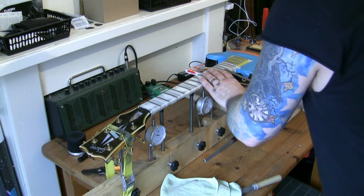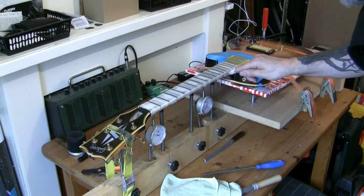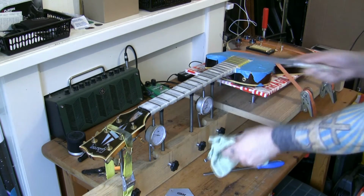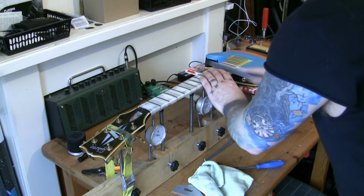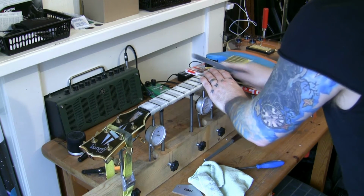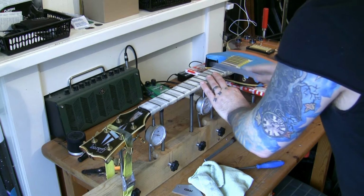What you're always looking to do is maintain that semicircle on the edge here where the bevels are. Just maintain that semicircle and you're going to be just about right. And then we'll go to the 2.5mm. Give it a wipe. You may not see a lot happening, but trust me, this is working. I can feel it cut in.